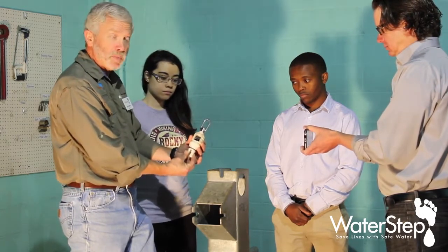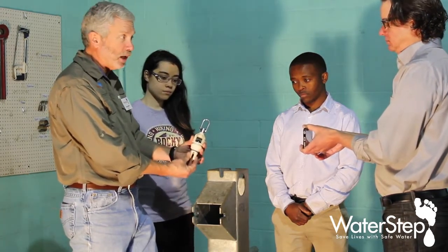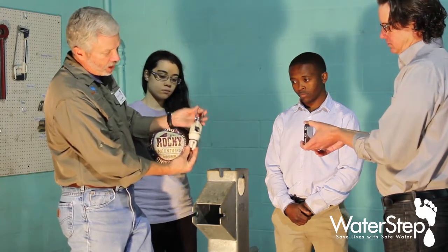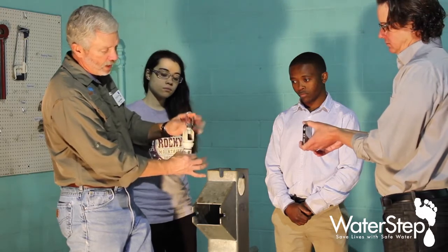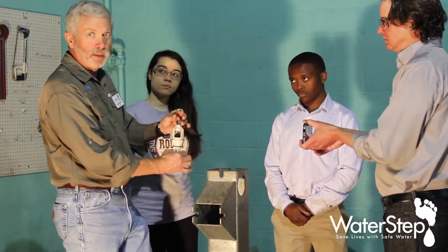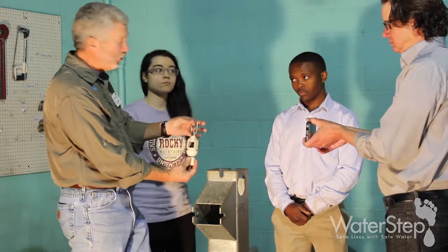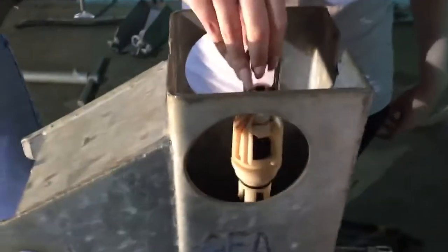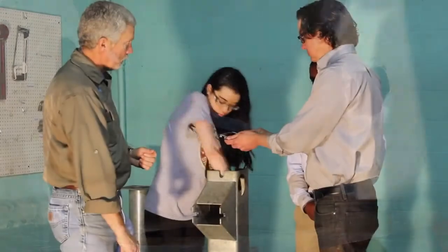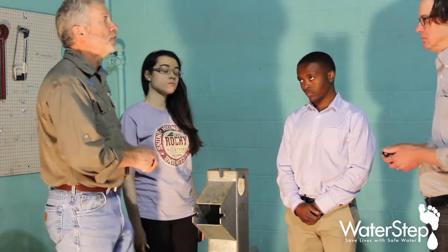So this is our bottom check valve or foot valve. We've done our inspections — now we need to put this back in the well. This is the first thing that goes back in the well, and it's the only thing you ever intentionally drop down the well. You drop it down; these four pins here go in and will either settle down or snap into place. Make sure the loop is up so you can retrieve it. Reach your hand down to get it started into your rising main, then release it — it slides down, may hit the water and slowly settle.